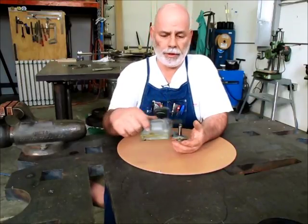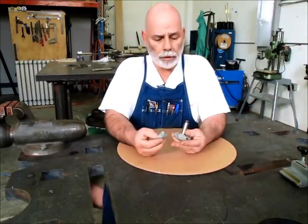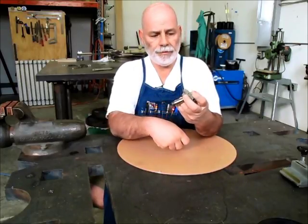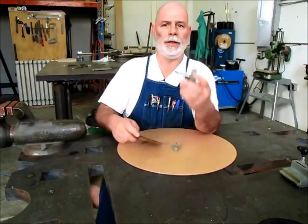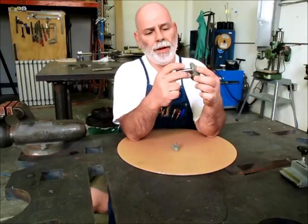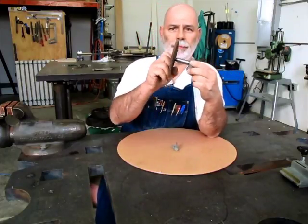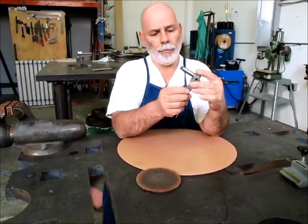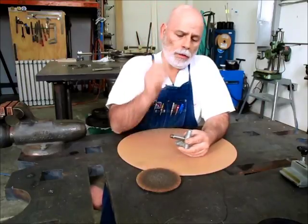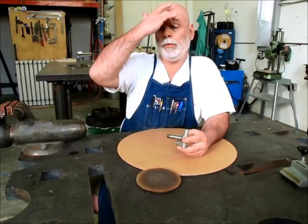This thing's in pretty good shape. The part that really got damaged is this bit right here, and you can see it's broken in two pieces. The bearings of the band wheel sit on this hardened stud here. And this thing does the blade tracking. So this little arm here that broke off, a screw pushes on that and it tilts the wheel and gets the blade tracking where you want it. So it's pretty important that it work.